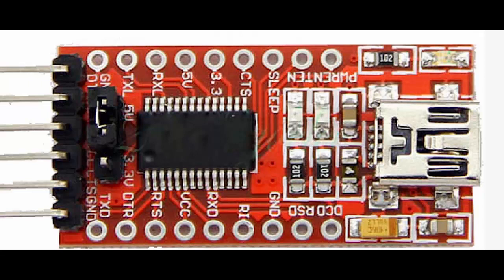Note on the top left-hand side, the pin is labeled DTR, and on the bottom you'll see a pin labeled ground. On the right, you see a connection for a USB cable. So what we do is connect the USB cable to the computer, insert the pins properly — DTR and ground — into the respective pins on the Mini, and then load the program.